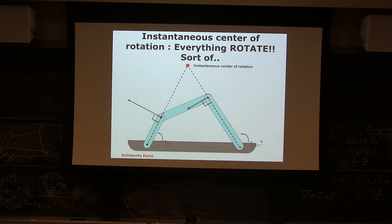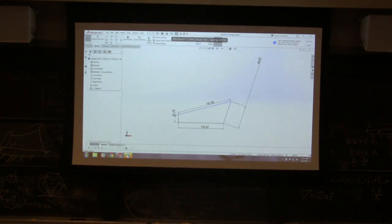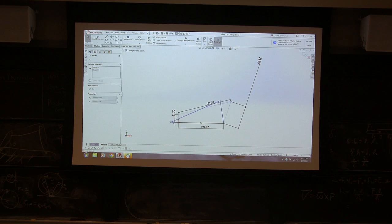All right, so I'm going to edit the sketch. So this is one thing you can do. You can define length, and you can create this kind of 4-bar linkage whenever you want to really think about how to design a mechanism. That's not cool, so I need to get rid of this. Now show it. Awesome. So this is a 4-bar linkage, 1 degree of freedom, right?